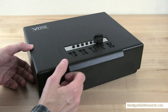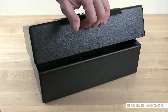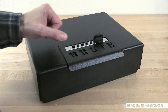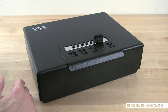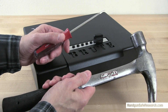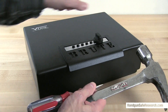Now the minuses. Like other pistol boxes of this basic design — a steel box with a simplex lock — the gas strut inside tends to want to fight you when you try to throw the lid open. And if you let the lid drop, the strut doesn't catch the lid. The other issue is the simplex lock. There's no reinforcement holding the combination chamber in place. This means I can use a couple of common household tools, defined as such in California's firearm safety device testing standards, to try knocking the lock through. And what I'll show you now is the results of some testing.